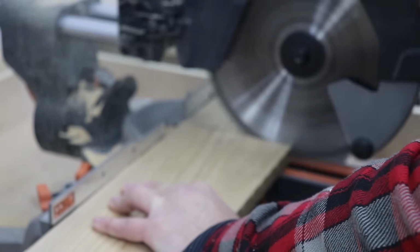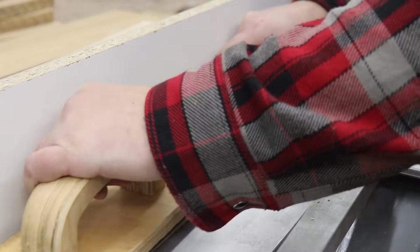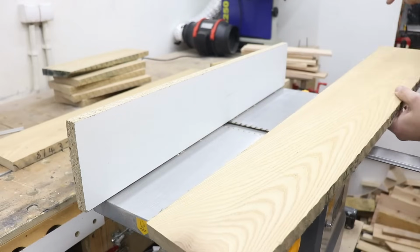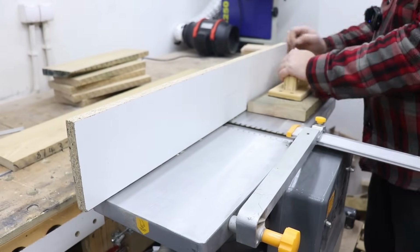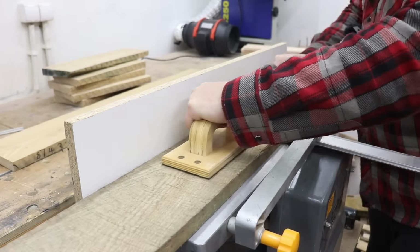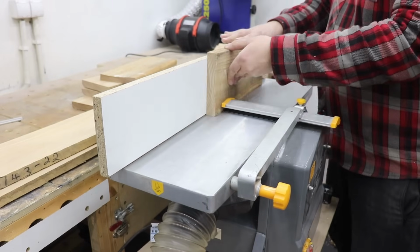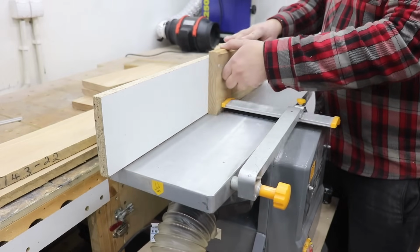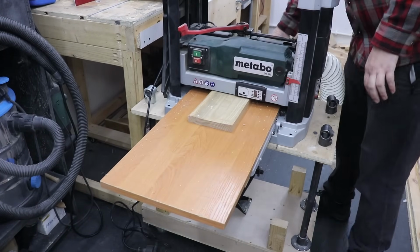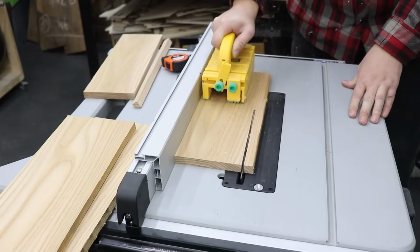Hence, the first one, I'm going to chop into smaller pieces, 35 centimeters long, whereas the whole box will be about 32 by 32 centimeters. So I've got a bit of wiggle room to dial in the size of my box. The second board, I'm just going to chop in half, and we'll go from there. I have also cut a few pieces of white ash. These will be the dividers for the tea inside of the box, and also two pieces of American walnut. These will be the splines that will go around the box, just as a nice decorative feature.